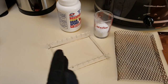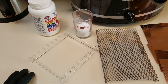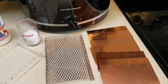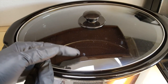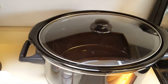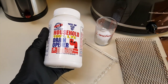This will allow the copper plates to sit inside the crock pot vertically and provide enough gapping so they can be evenly coated. If you don't have access to build something like this, you can take copper wiring and basically hang the plates inside the crock pot — run a copper wire through the inside, wrap it through all the plates, come back on the other side, and do the same on the opposite side. That is totally possible too.